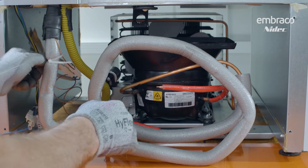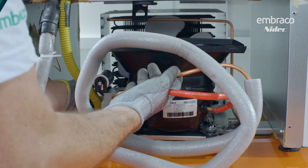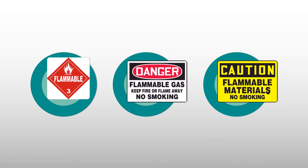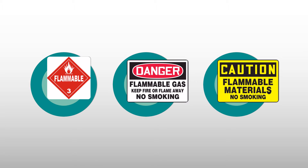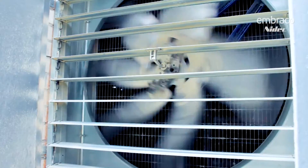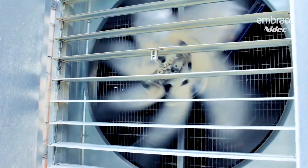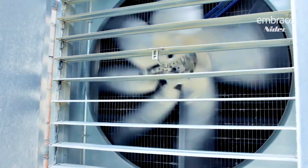Leave the hydrocarbon gas detector running on the ground in front of the cabinet for the entire performance of the maintenance. We also want to use a safety placard. Since we have flammable refrigerants in these systems, you want everyone else around your job site to know you're working on a flammable refrigerant. Make sure that you have ventilation — preferably an R290-proof fan right there on your job site. In case you do have a leak, it can blow that R290 away.